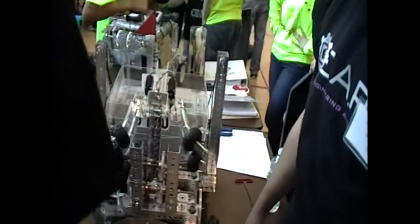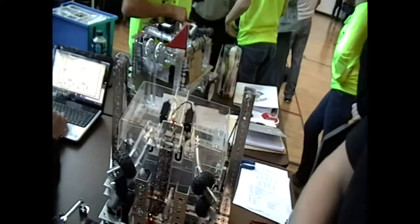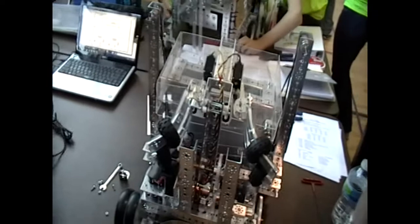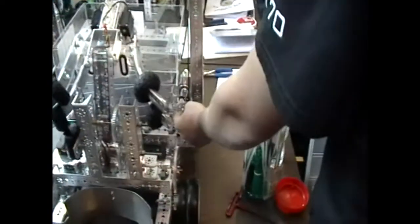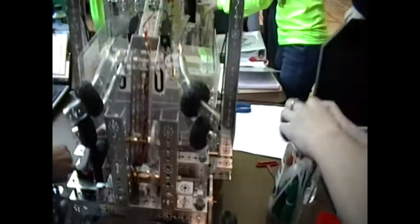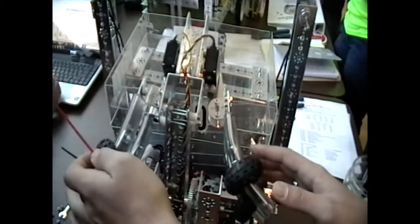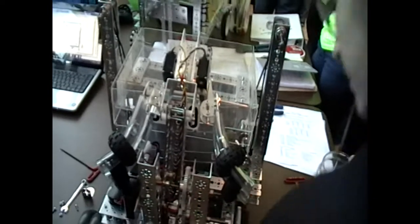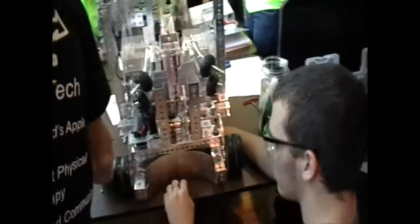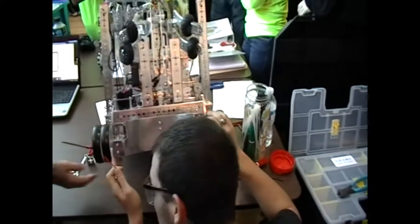I see that you did fabrication — cut pieces of aluminum bar like that. So there's a scissor lift design. How do you lift the scissor lift? These motors here spin, pull this cord up on both sides, and it just lifts it. There's a bar in the middle. So this right here grabs the crate, and this closes around the ball as well. We also have our thing on the front to push the ball around. You're a very well-rounded robot — and positioned so the balls won't get stuck entering. We're geared up, it's really fast for the gears.